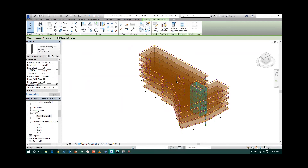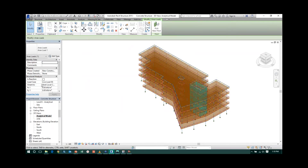The analytical model consists of loads and everything. If I click on any slab, I can see the live load case — live load in the Z direction is minus 3 kilo Newton per meter square. You cannot take the architectural or structural model from Revit to Midas directly; it should be the analytical model. You need to make the analytical model before taking it to Midas.